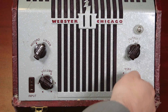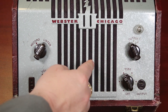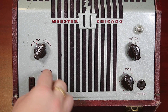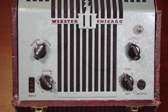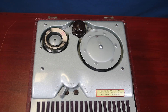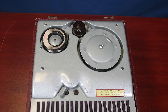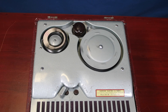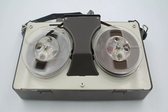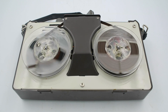Let's turn on the unit and wait for the tubes in the amplifier to warm up. Make sure it's on output 1 — the internal speaker — on listen and not record, and with the volume turned all the way up. Then turn the switch to play. One of the things you'll notice is the great speed at which the wire travels through the machine: around 24 inches or 2 feet per second. This is significantly faster than on a typical tape recorder, which means you need a considerable amount of wire to record a relatively small amount of audio.